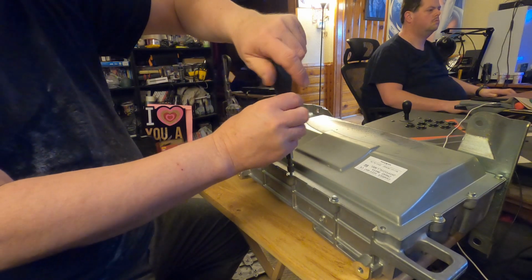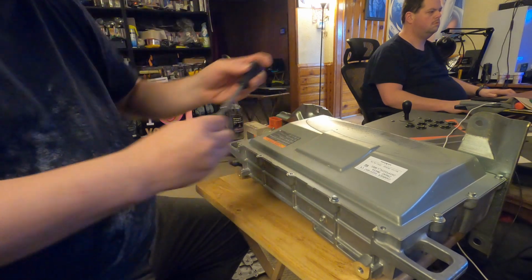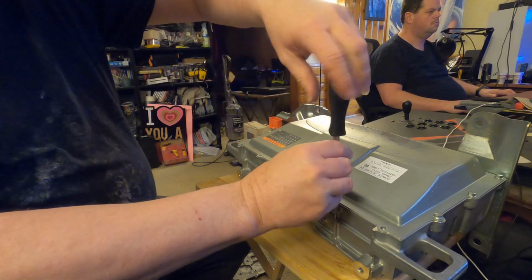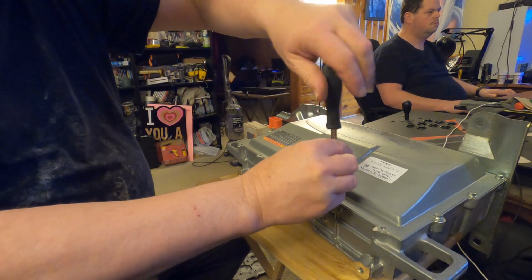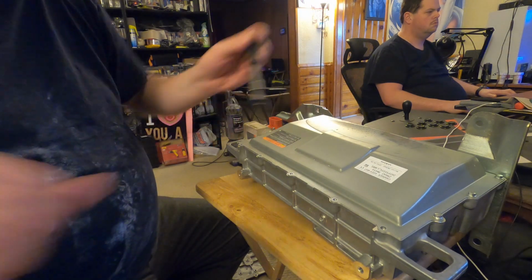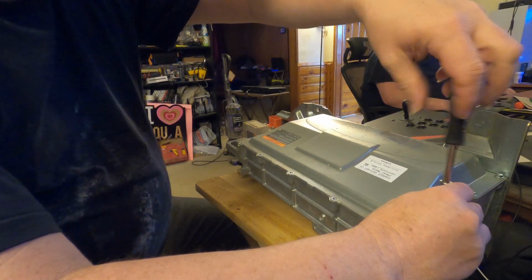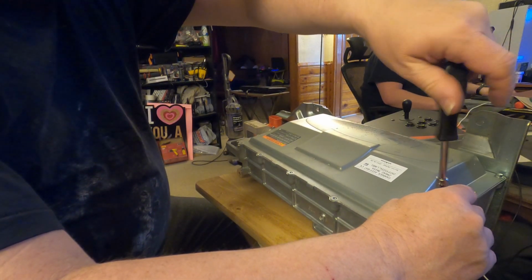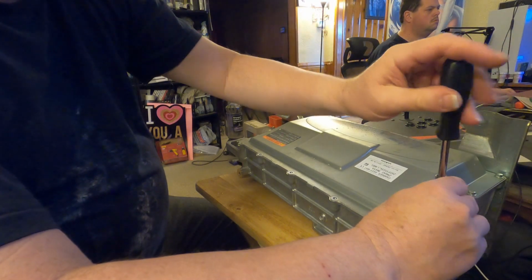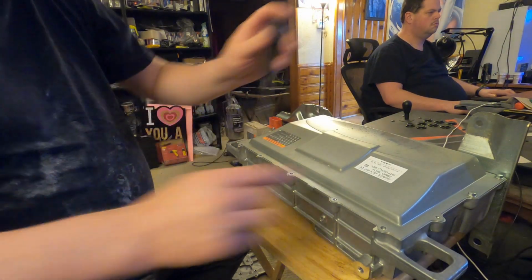And for those that are curious, yes, if your onboard charger fails a diode test, there are instructional videos out there to detail making a repair. There's a couple of options out there. If the diode fails open, you will still have to take this charger out of your car, and you're going to have to effect the repair internally going through this process.